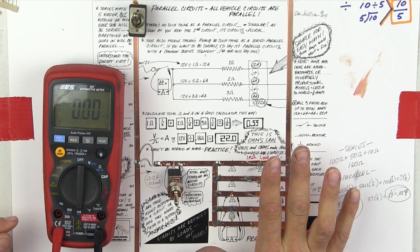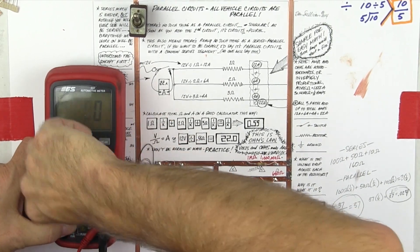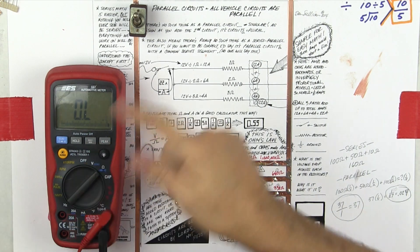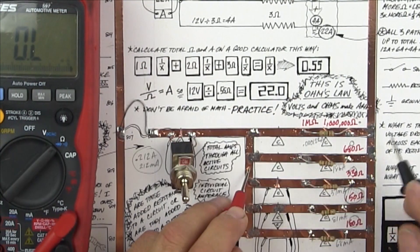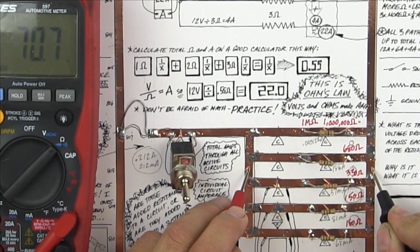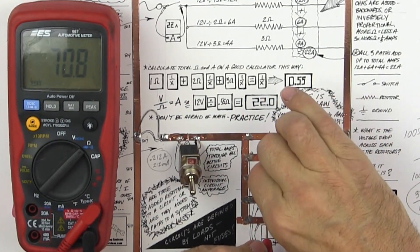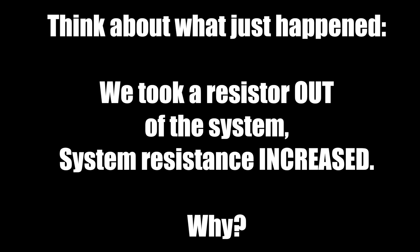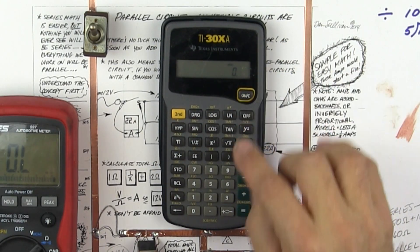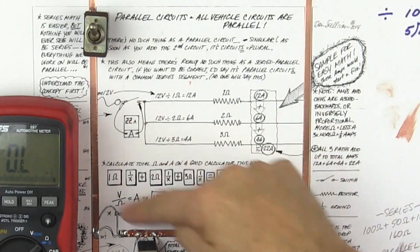The total system resistance just went up. I can prove that — it was 58 ohms before. Rather than flipping through meter ranges, let me demonstrate: with my 'magic switch penny' it drops back to 58; take the penny out and it goes back up to 70 ohms. So removing a parallel resistor raised the total resistance from 58 to 70 ohms. That makes sense.